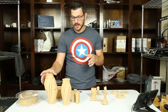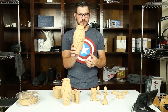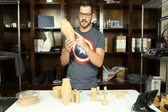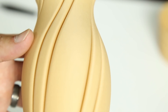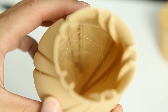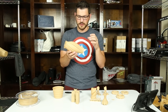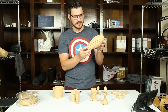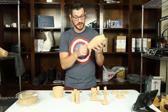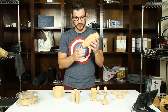Then I tried some other vases. This one was a giant fail on the Geeetech A10 because I was having an issue with my thermistor when it broke — it started out really nice and then just went downhill. Then I printed this one on the Geeetech A10 and it came out much better, but inside it's super duper stringy. I don't know why because there are no retractions in vase mode — it should just be going around. I'm guessing with the fan blowing so hard on it, it makes it a little hairy. On the outside, if you just run your hand on it, it pretty much takes the strings off. Inside is a different story — those are harder to reach and more attached. But overall, super duper smooth walls on this — the prints came out really, really well.